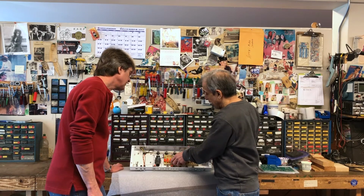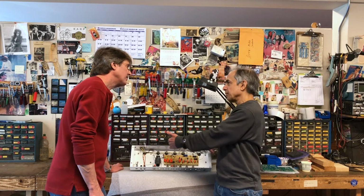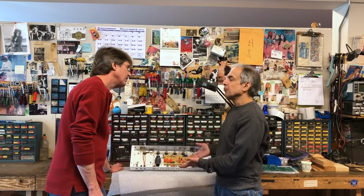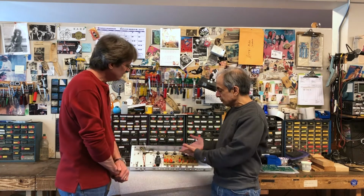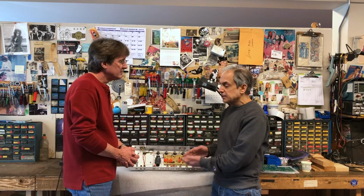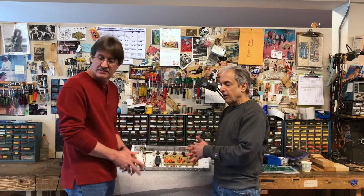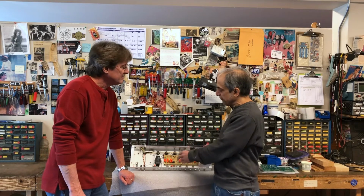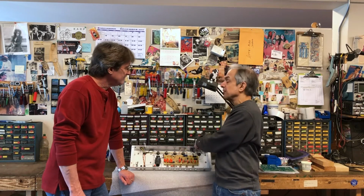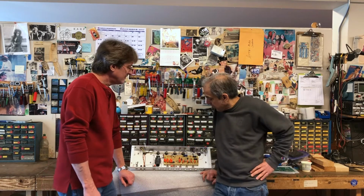So this is now basically just doing a more surgical separation of the preamp and the power amp, and it's just a different way to run effects. And this was a request by your customer to get this special thing, and this is the loop that is also now in our Hot Rod 25, because the Hot Rod 25, being a new design, I wanted to address some of the newer uses of these kinds of pieces of gear. So this is basically the Hot Rod 25 loop, put in an SLO with the addition of this extra volume control on the back, and it's going to probably be pretty awesome when it's all done.